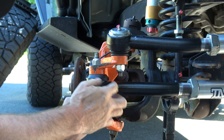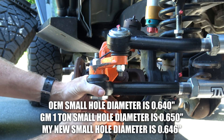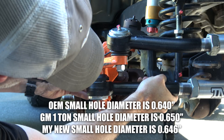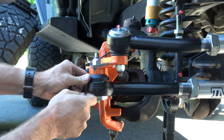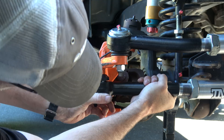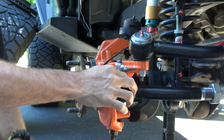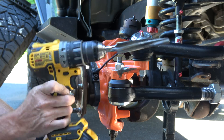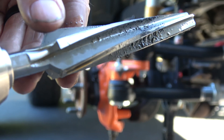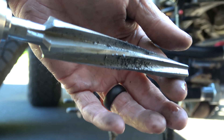That's pretty good right there. Basically all I did was bring it back to OEM specifications, and you can see how that washer now fits and restricts the flop. That's all it took — a couple of seconds with a reamer on a drill. You can see the amount of metal that got removed — not a lot, but enough to make a huge difference on the fit and assembly.